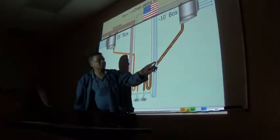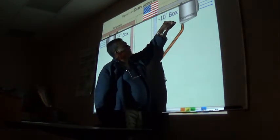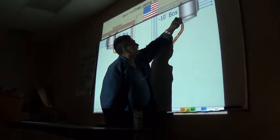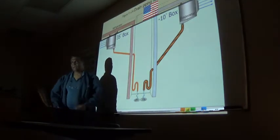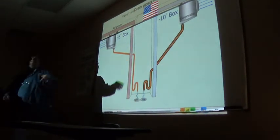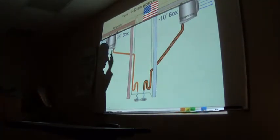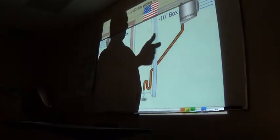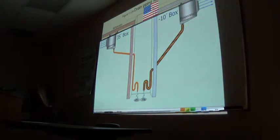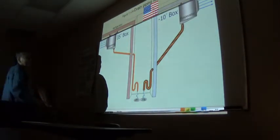And you see, apart from this heater that's wrapped around this pipe, a lot of times this looks kind of clear. You see that black thing in there? That's an internal pipe heater. So we also push a heater in there and hook it up in parallel with this heater. So you have two forms of protection. You put the heater element in the pipe. It looks like a brazing rod with two wires coming out that you hook up to line and neutral.